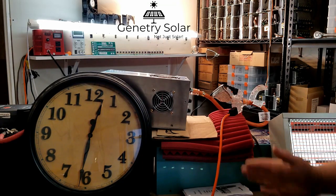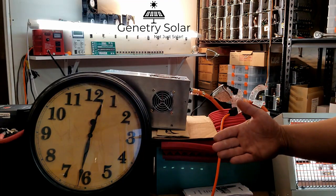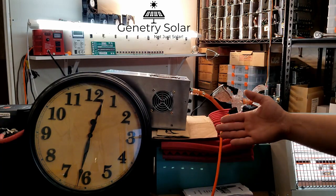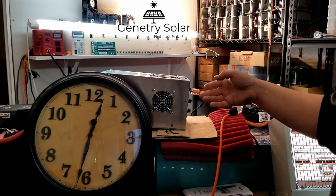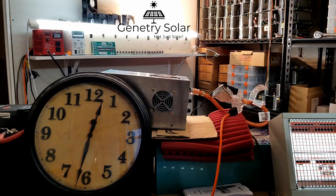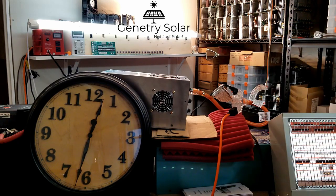I think if my batteries could last longer it would keep on running indefinitely. When an inverter is being overloaded or running near its max, number one the fan is going to be on all the time, number two you're going to have an extreme dip in battery voltage, the sine wave is going to look like crap, it's going to alarm and start beeping, and eventually shut down. We are going on over 30 minutes now and it has not done any of that. It hasn't complained about heat. It turns the fan on once in a while because the transformer is warming up, and that's it.